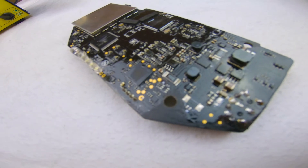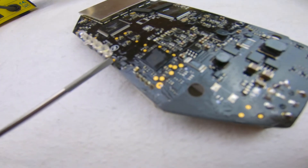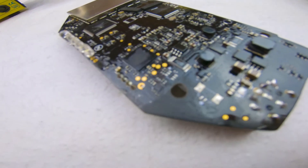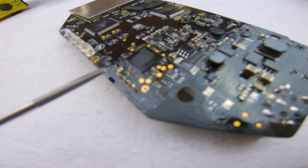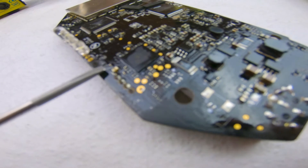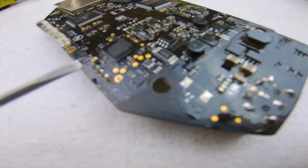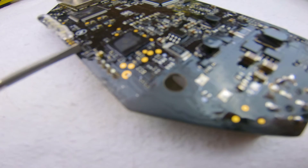The board is coated with something — I'm assuming it's a type of epoxy or plastic. When I zoomed in, I noticed right on this chip there was a hole in that plastic, and the black outer casing of the chip looked like it was burnt away around the contacts. I could see some gold inside, indicating maybe there's no fault there. But when I heated the area with an old soldering gun, I may have spattered some solder that burnt that coating.